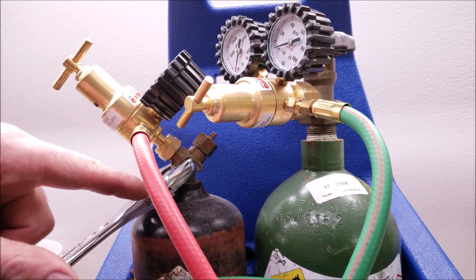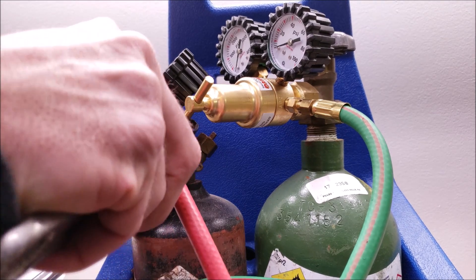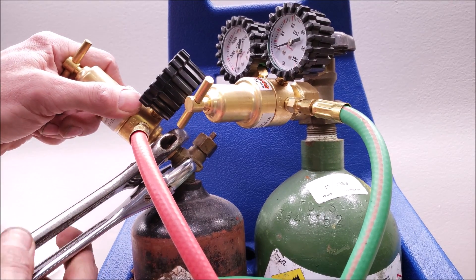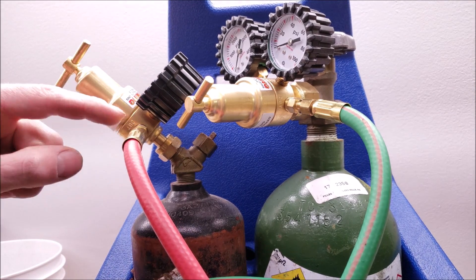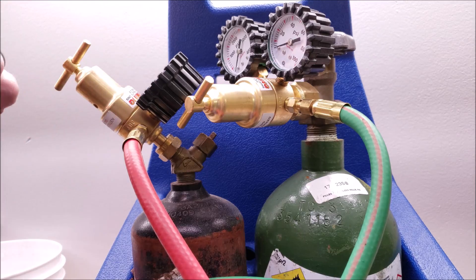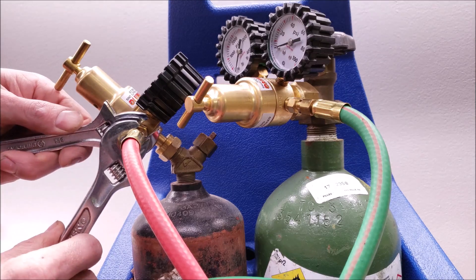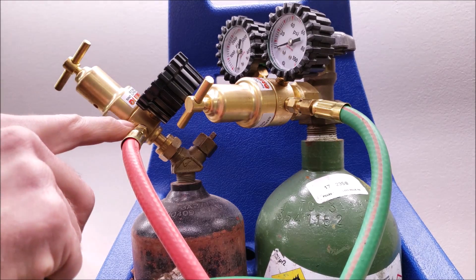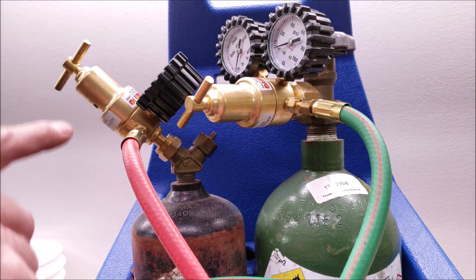This is your acetylene tank. You're going to have one adjustable wrench on the neck of the tank and the other on the acetylene regulator nut. Turn that clockwise — it's a right-hand thread — until it's snug, then tighten the hose. This hose is a left-hand thread on both sides; it attaches into the handle. Put your six-inch adjustable wrenches on here and snug it up. Make sure not to over-tighten — it's easy to strip the threads. Just snug, and that's it.